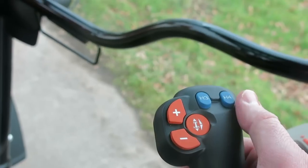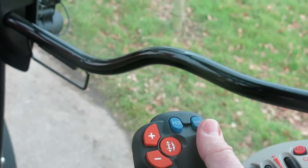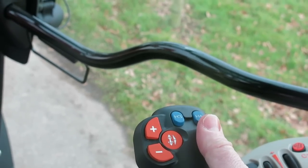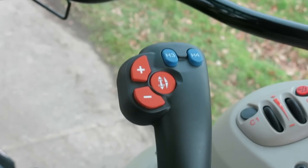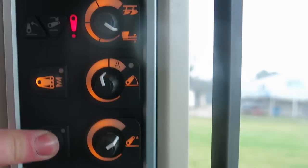What's the hydraulic output on this tractor in its current spec? With this one, if you have the twin flow you're up to over 100 litres a minute — very fast controls. For a loader it's brilliant, and the twin flow is probably the most popular option with us. It's just as simple as switching it on and off on the pillar up there.